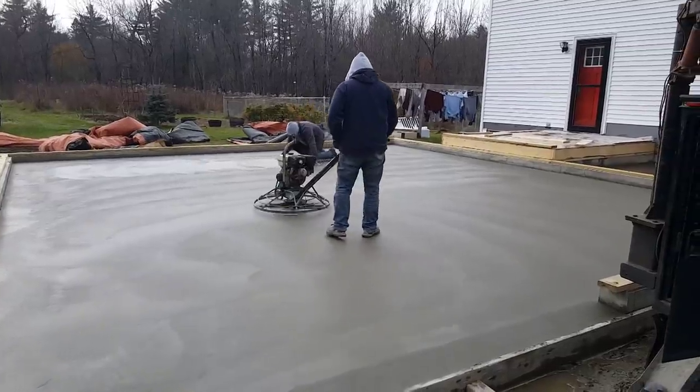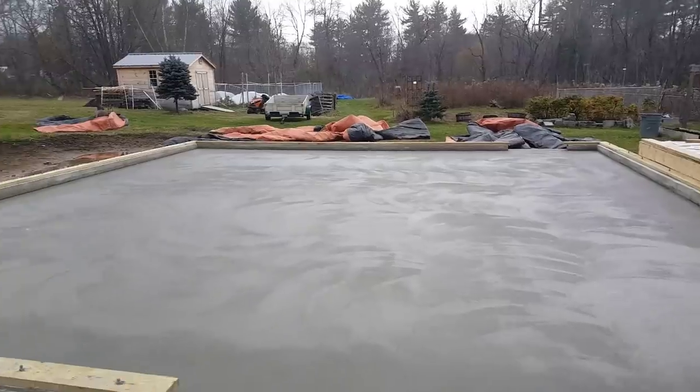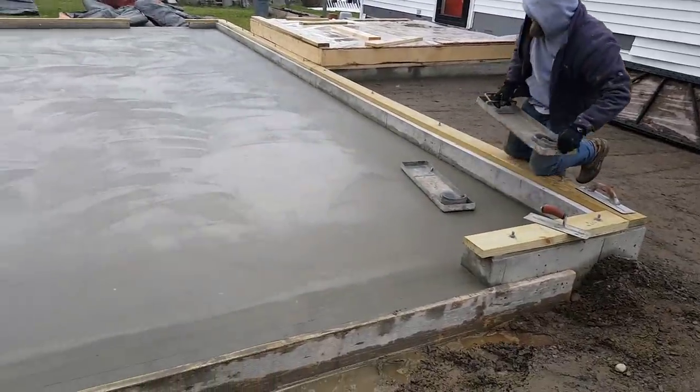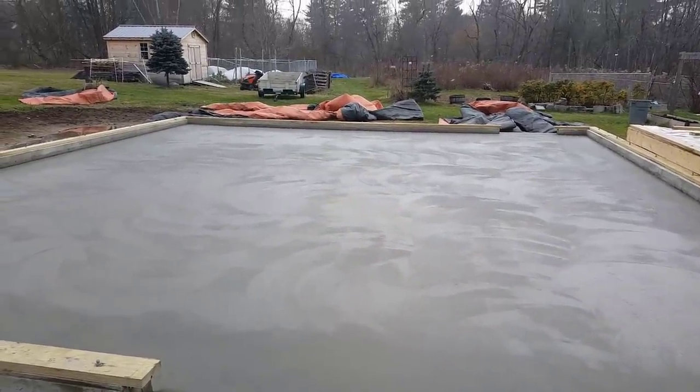And then after we got it knee boarded and hand wiped like this, we let it sit for about a half hour, and then we sawed our expansion joints in it. And that was it, guys. That's how we finish concrete in the cold weather. That recipe works really good. We'll see you on the next video.